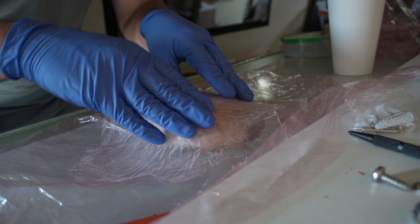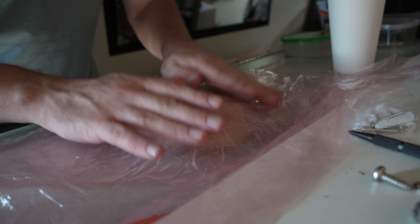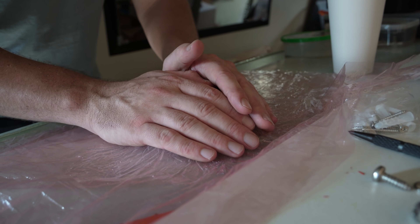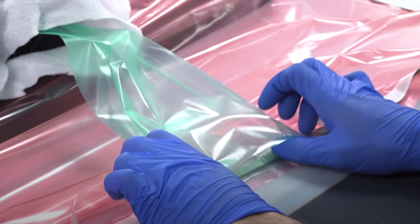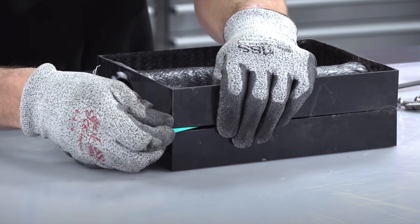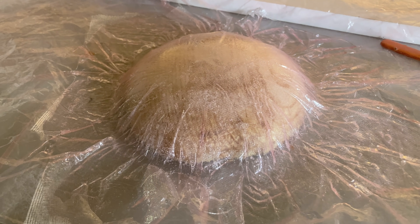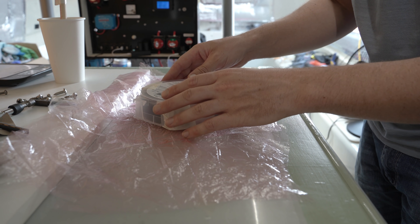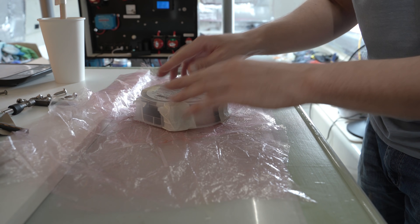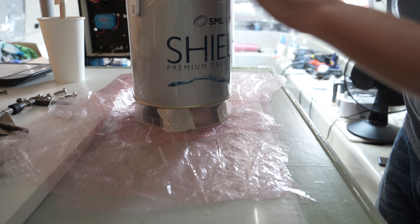Anyhow, it was a resounding success, and another layer of release film got placed on top. I want to make half a dozen parts, and this makes deciding on technique difficult. It's enough to make using my vacuum machine wasteful in terms of bagging materials, but not enough parts to justify making a dedicated two-part mould. Also, weight isn't a concern, so I don't need to squeeze out the last gram of excess resin. Instead, I use the suitably sized pot to fit over the release film, and ensure the glass fits tightly around the edges and in general hugs the pattern. Let's see how this test works out another time.